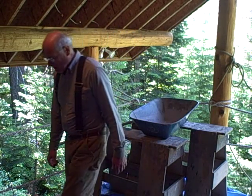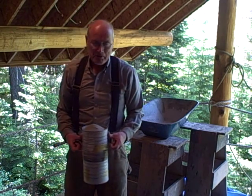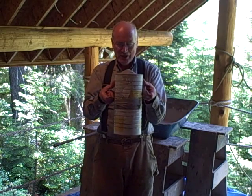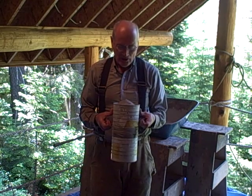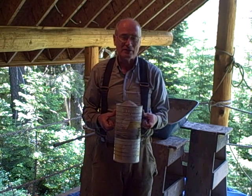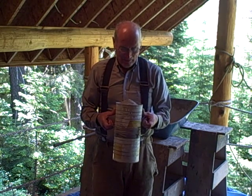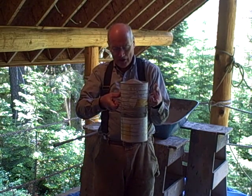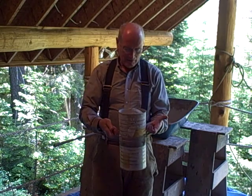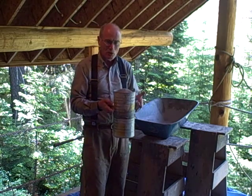So the trick is to measure it. I made a measuring vessel for the mortar itself. After a few experiments, I found that two number 10 tin cans full of mortar mix is the right amount for one batch. You can work that and get it in place without it setting up too fast, and it's not too heavy to carry up the stairs. I've connected two coffee cans together and wired handles in the middle near the center of gravity so it's easy to tip it over and dump it.